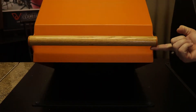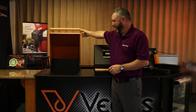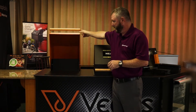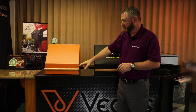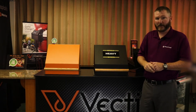You can see wherever I let go, it stays. We're actually counterbalancing it all the way past 90 degrees, past the pivot point or center of gravity. And on the way down, wherever I let go, it's just going to stay right there. So that's an example of two different lids — with and without a counterbalance.